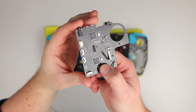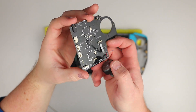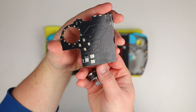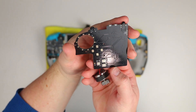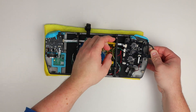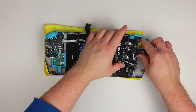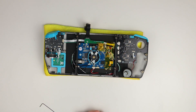Last but not least, here's the left controller PCB. This one required the most changes, with the addition of the 3.3 volt regulator that I forgot last time, along with extra connectors for the USB hub ports so I can connect the touch screen and power management internally. This one also got the same ENIG treatment as the right controller PCB, along with swapping the joystick connector pins to provide 5 volts to the joystick so that both sides are the same.